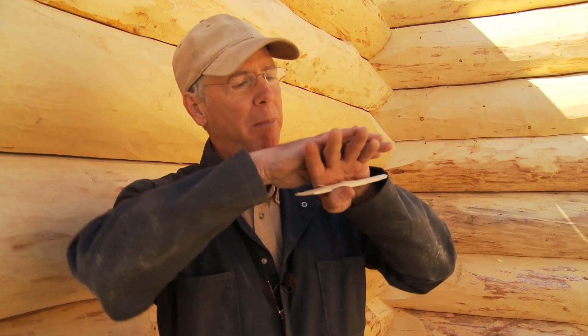All pines and spruces start out their lives with a bit of left-hand spiral twist to their grain — it's sort of juvenile wood in gymnosperms to start out left. So if on the surface of the log you now see a straight grain or a right-hand spiral, you know that it has changed over time. It changes just a half a degree each year for a hundred years and there you go, you get a spiral grain. But if the log is still left-hand spiral on its surface and the surface is 90 or 110 years old, then you know that log is left-hand spiral grain all the way from the core to the outside, and there's no way to balance those drying stresses — they're all lined up the same way, left-hand.